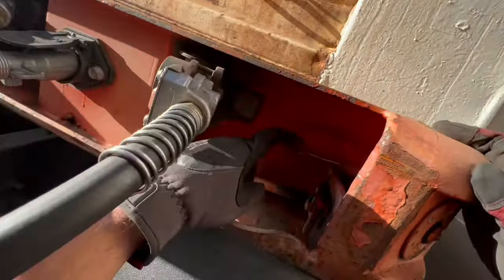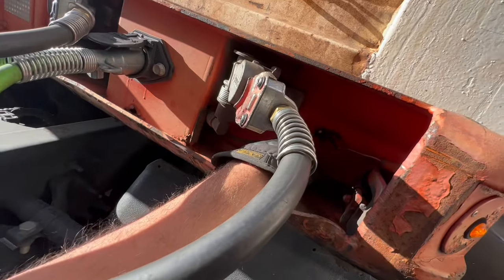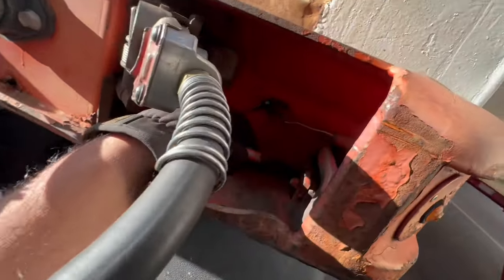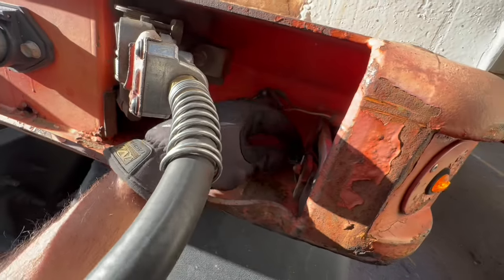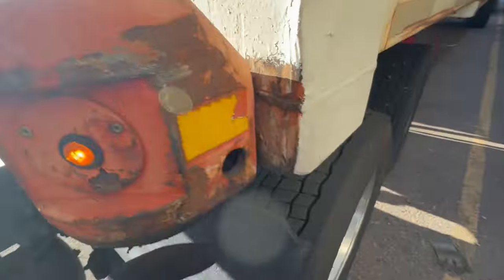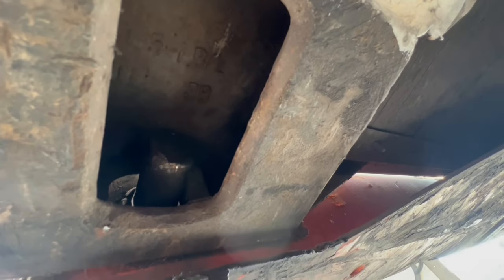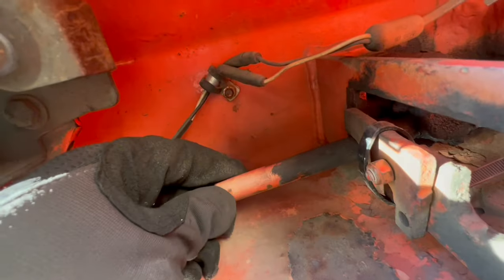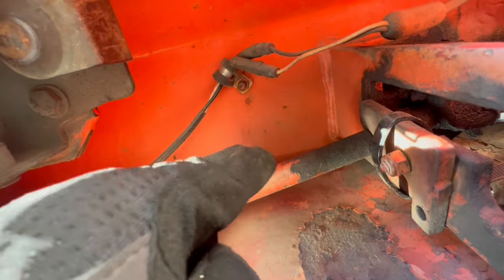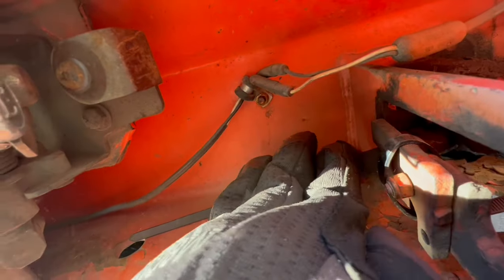While I'm here, I'm going to show you this push lever in the front — this secures the front end of the container. It's kind of locked right now and it's secured. What this does is it goes through a hole, and you can see the pin that it's going through. That's what's holding the front end of this container to the chassis. That's why you want to have a zip tie like it shows right there — securing it so that with the vibration while driving, this doesn't go back and release. So this is secure.